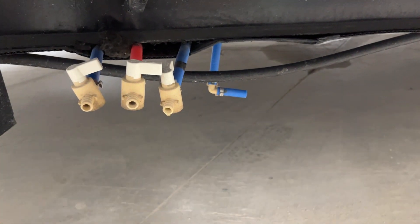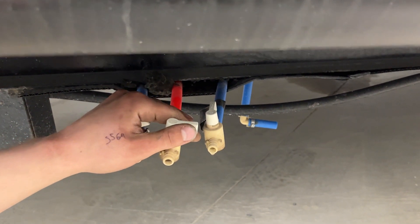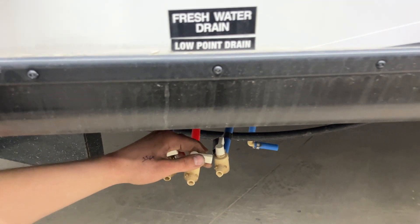There's a secondary vent, so you will see water coming out of that as well. These two lines here are low-point drains — open those up and they allow the water system to drain itself out, so if you're leaving the unit for a while or getting ready to winterize it, just drain all that water out before doing so.